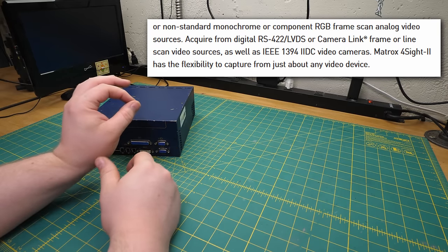Getting back to the Orion — it appears to have been a follow-up to the Matrox Meteor 2, which was sold as a plain PCI card with that same 44-pin connector breaking out to 12 separate camera inputs. I found a cable for this on eBay — I almost ordered it, but it was $100 and seemed a bit much. Despite all those inputs, it only had one digitizer sitting behind a 12-to-1 MUX — a multiplexer, which is a fancy term for a switch. So you could connect 12 cameras, but it could only capture from one at any given moment. That's a bit disappointing. But consider: what's the point of grabbing all 12 images if you can only process one at a time?